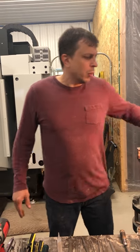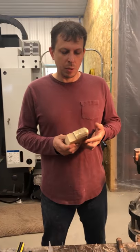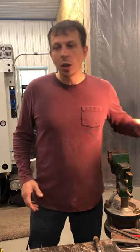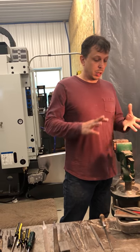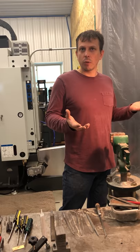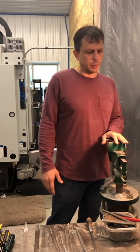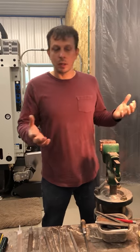The butt plate, one thing we have to consider is how to hold parts when we're polishing them, which can be a little bit tricky. We have the option where we can actually just polish the butt plate right on the stock. So squeeze the stock in the vise and then polish the butt plate. It can work fine. I've done that lots of times. The only thing to note with that is it can be a little cumbersome to manipulate the stock.